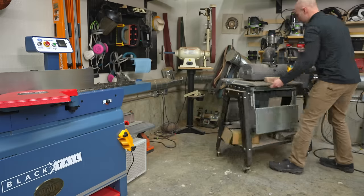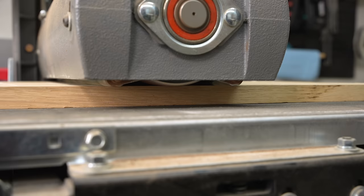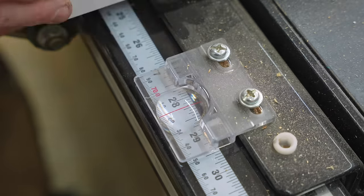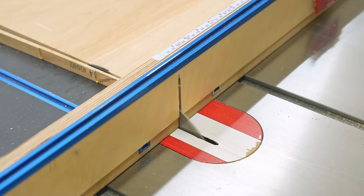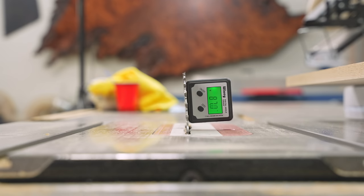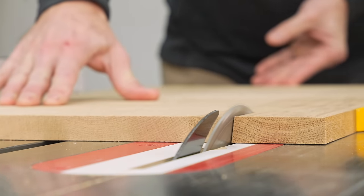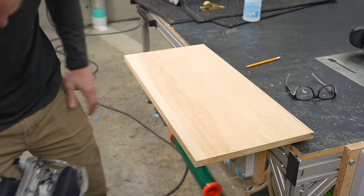The design I'm going for is similar to my personal dining table, only that one was made from three-eighths inch thick plate steel with two legs and a stretcher. This is just going to be one wood free-floating leg — which is probably where Scott's uncertainty comes from. I'm getting them nice and flat because I'm going to glue both together at about a five degree angle, which I think will leave a really interesting look. I use a digital angle gauge here — normally I don't find them very accurate, but for a five-and-a-half degree angle where being off by a degree or so is fine, it works perfectly.